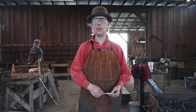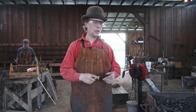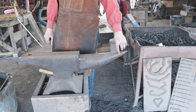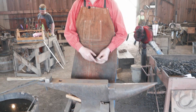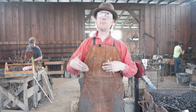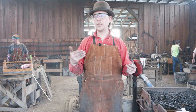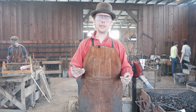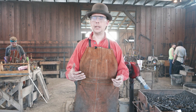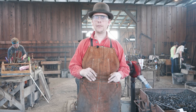We need to make sure it's got a 1-1/8-inch interior diameter. There are a couple of ways we could do that — one is we could measure a 1-1/8-inch wide section of our anvil and wrap it around that. But this is the ABANA national curriculum and we're building to more advanced things like the gate latch and eventually some grills, so it's important to understand the math. We need to be able to calculate the amount of material we need, so let's talk about how we calculate — even though we're told to use seven inches.